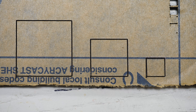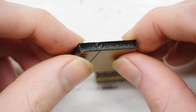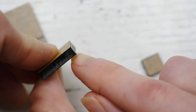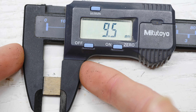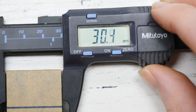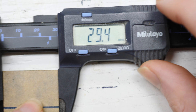Let's investigate what's going on. You can see the parts kind of wiggle around. Looking at one of the parts, you can see the curved edges from the laser — also not normal for what I'm used to from a CO2 laser. It seems like we're melting these things. Let's check dimensional tolerances. This is supposed to be 10 millimeters but it's 9.5. This one is supposed to be 20 and it's 19.7. This one is supposed to be 30 and it's 29.6 — even 29.4 in some spots.